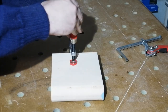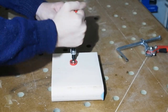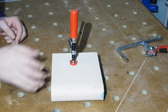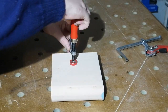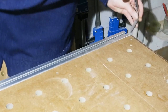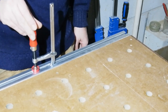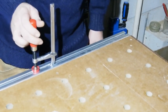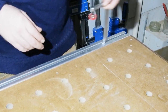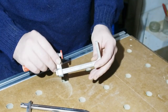Some of my frame clamp-ups make the ratchet type almost impossible to use, so these straight up-and-down screw types are preferable in that instance. Pressure is good with these and they're not really any slower to use than the ratchet. Find them pretty much doable with one hand too, which is a nightmare with the ratchet type. As you can see here, it slots into my 40mm profile at the end of the bench with its 8mm slot. Dimensionally the foot of the bar is the same as my Axminster and Bessey ratchet clamps.